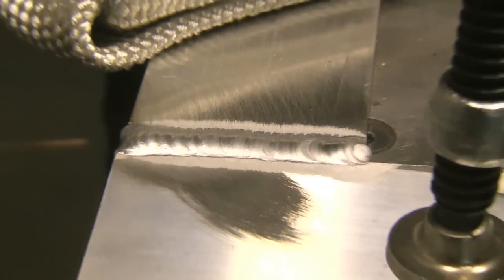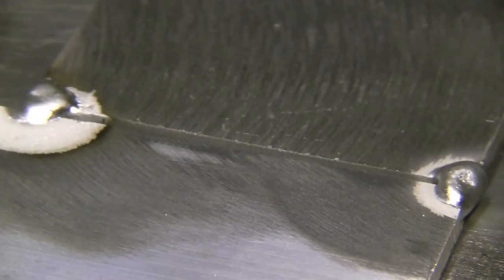When you ball an electrode it welds nice, but at low amperages that arc wanders all over the place. Here, even when I taper down really low, I've got a stable arc — so filling that gap in was nothing.